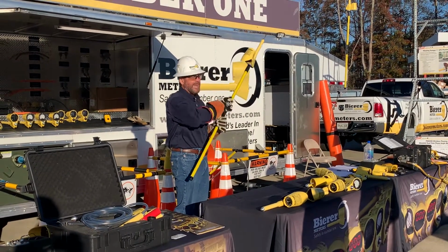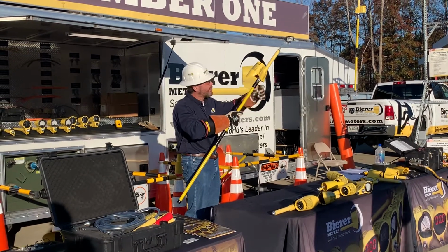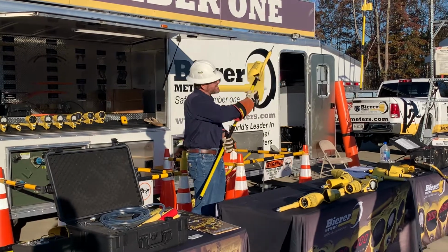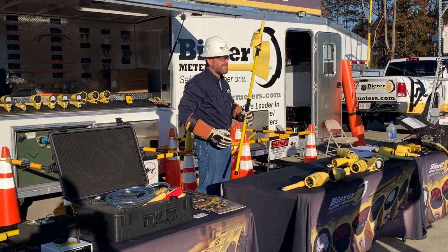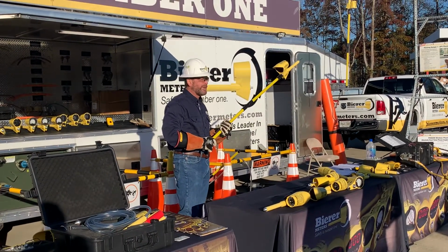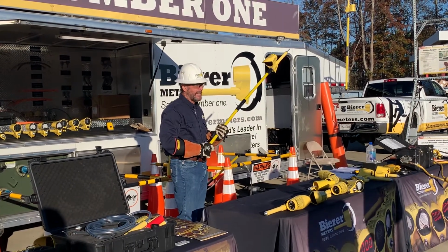Make sense? If it's corded, and that cord comes out of the meter housing towards you, you better add whatever inches that is. So say it's 6 inches coming towards you, and let's say your utility says 24 inches, well, you better be 30 inches back now. And that needs to be in writing as well. Treat the cord as if it's energized, right? Right? All right, guys. Good.